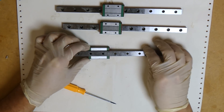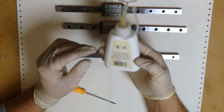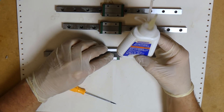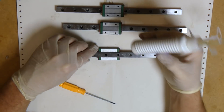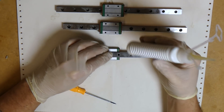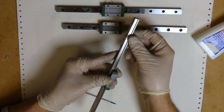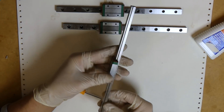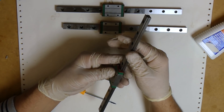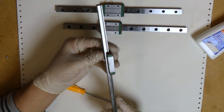What we then need is some really high quality bearing grease. This is very expensive stuff — it costs almost as much as all three rails. You can also use machine grease, but make sure it is free of acids and not too sticky. Try to find a bearing grease. Once it's cleaned, apply some grease into the rail here, here, here, and here, and move the block forwards and backwards until it has taken up enough grease. After that, wipe everything off, move it again, wipe it off again until you see almost no greasy residue on the sides, and then you're good to use these blocks.